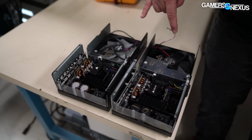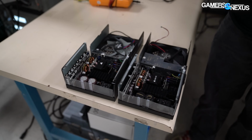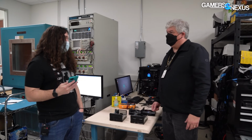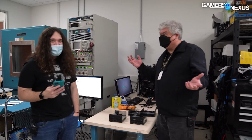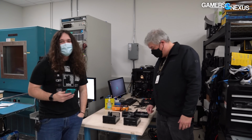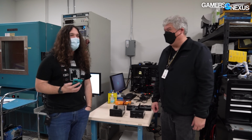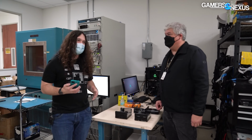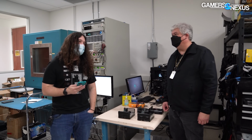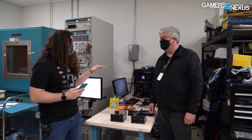All this stuff needs some airflow. And if you put a heat sink over the whole thing and the air can't get through it, you're not doing anybody any justice. But John, then it's a giant heat sink. It must be great. So much aluminum. So it comes back to, more is not better. More surface area can be better, but it has to be designed right. It can't create impedance too. And just being a block that's not cut doesn't create surface area.